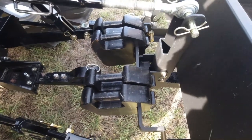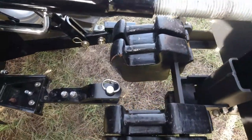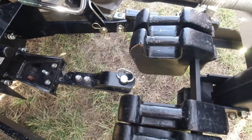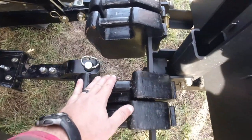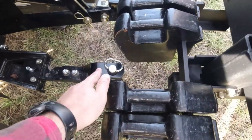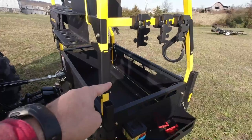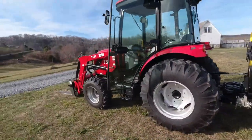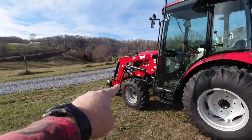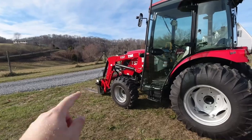And the tool rack guy says you can put, you know, three on each side, but this tractor has a really good size drawbar, and I'm glad it's like it. It's heavy duty. And if I add one more of these suitcase weights, it's gonna start hitting that drawbar, and I don't wanna do that. You can add 600 pounds to the tool rack. When you got heavy weight, such as big logs like we have here at the mill on the front end loader, you wanna counter that the best you can because it's more stable, a lot more safer.